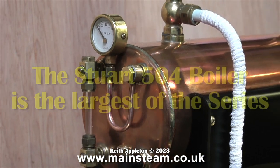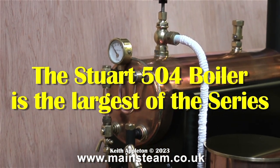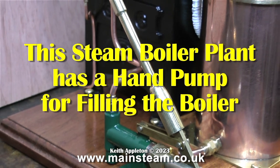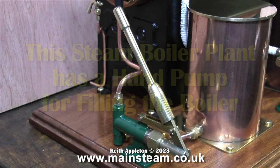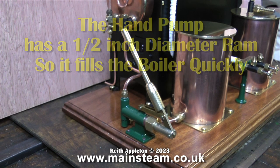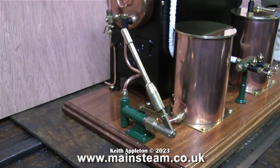A bit of information about the boiler itself. A 504 boiler is the largest of the series — there's a 500, a 501, and a 504. As previously shown, there is a boiler feed hand pump fitted to this plant, and this Stuart hand pump has a half inch diameter ram so it fills the boiler quickly. I made a nice brass extension handle for it. In this clip you can also see, fitted to the boiler, the water gauge drain tap and the drain pipe. This is used to blow down the water temporarily to clear any air bubbles from the glass, so you can always see exactly how much water you have in the boiler.